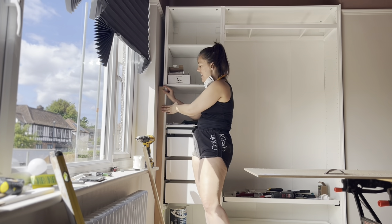I'll make sure it's flush with the edge and clean up any excess glue, then give it five to ten minutes to dry before sticking it on the wall. The piece of timber will be glued to the wall. I find No More Nails more than adequate for a project like this — there's not going to be anyone pulling it or any weight on it.